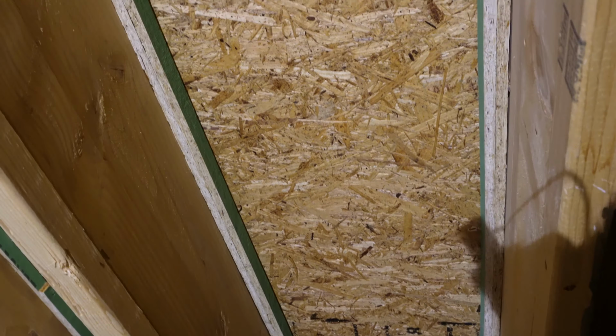And then the other big thing was making a work surface that was ergonomic. I really wish we would have done that at the beginning of insulation, because that just made things fly by, go a lot quicker. It was easier on our bodies and more enjoyable to do the work. So one piece of advice would be get some sawhorses, a piece of plywood, set it at an ergonomic height, and work on that work surface when you're cutting things rather than leaning over and cutting at the height of the bats.